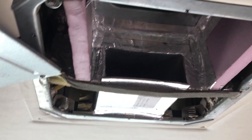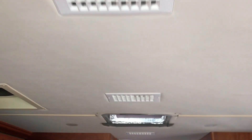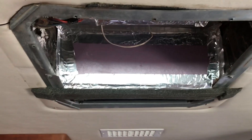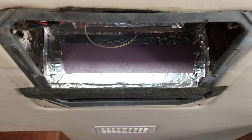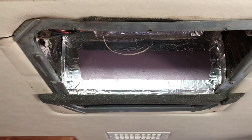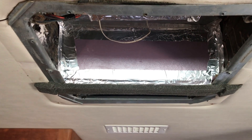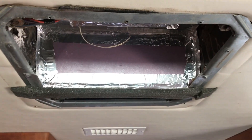With this setup, just creating these simple blocks, we're easily 30 to 40 percent more efficient than before — the air conditioner doesn't run as long and cools the place much better. The whole project requires one trip to Home Depot: foam core, a blade to cut it, aluminum tape, and spray foam insulation. I probably have about $15 in this entire project, and it's saving me a ton of money every month and making us much more comfortable.